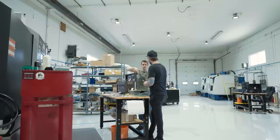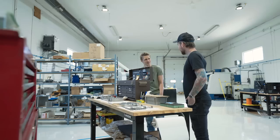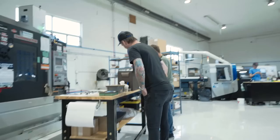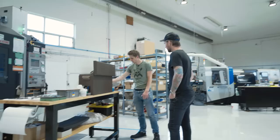So this one's a fixture and on that machine it's gonna be a tombstone — same thing. Everything's clamped in place, got to be located so it always goes back in the same spot. You just need time, you figure it out. It's like you want to make a thing, so how do you hold it? That's the first thing in machining — how do you even hold it?